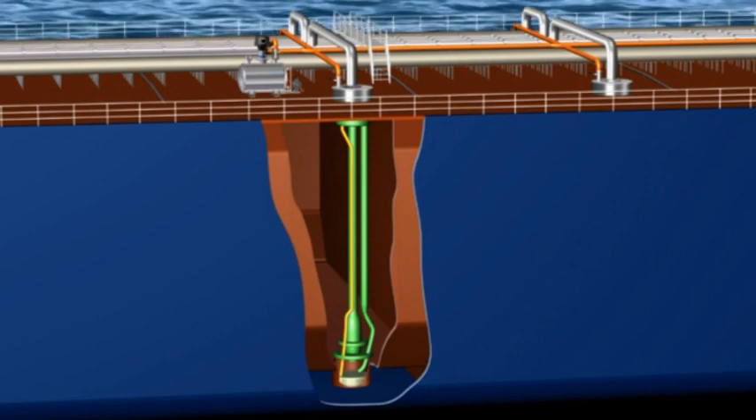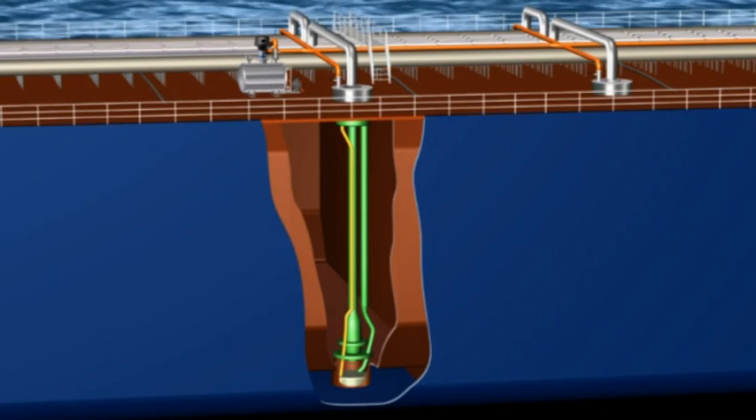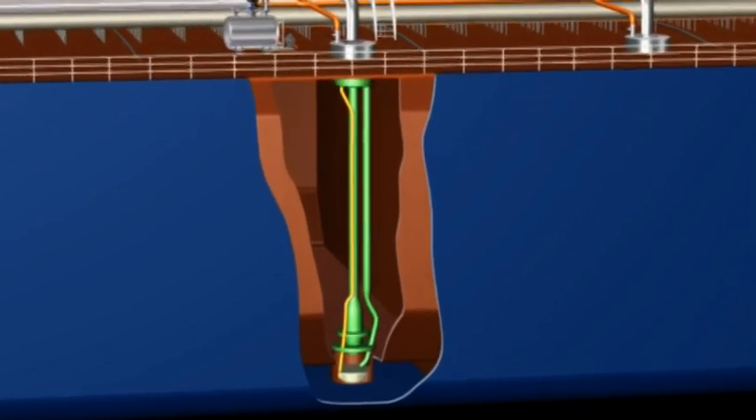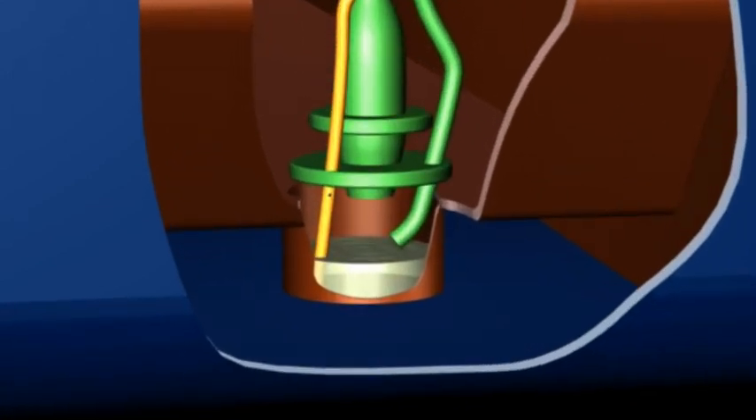The super stripping system consists of few simple parts, which makes it very easy to operate. An additional pipeline all the way to the bottom of the suction well, fitted to the cargo pump shaft, is normally delivered mounted from the cargo pump manufacturer.